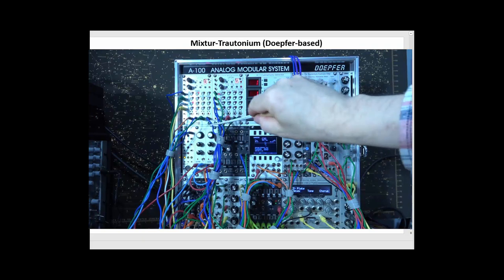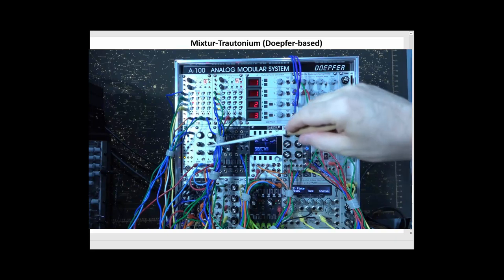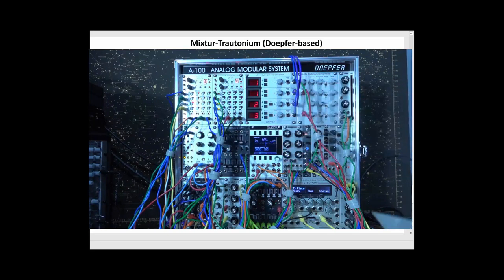There's a dual frequency shifter here that I send a couple of the waveform outputs to, and I can do different things with. All this is mixed together through a voltage-controlled amplifier mixer that sends the mixed signals to the formant filter, which then sends it to the ZDSP — basically a reverb unit running the Valhalla reverb cartridge.